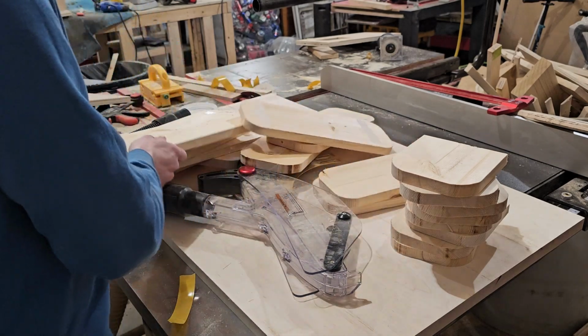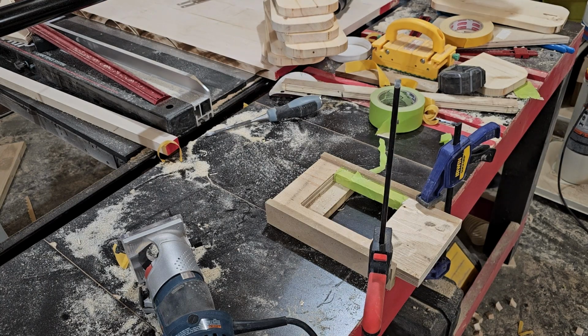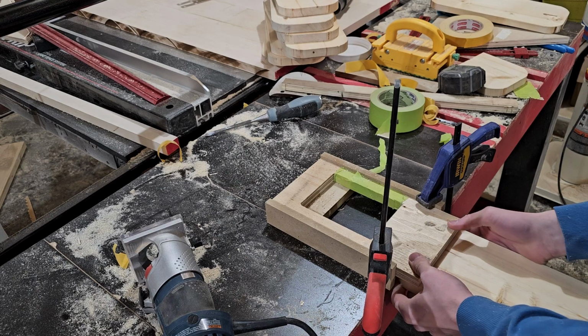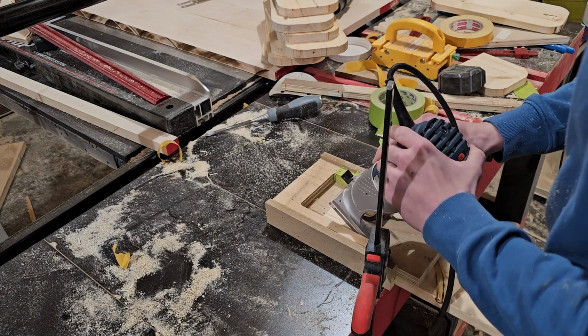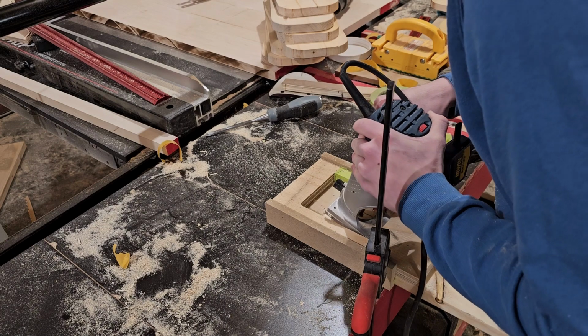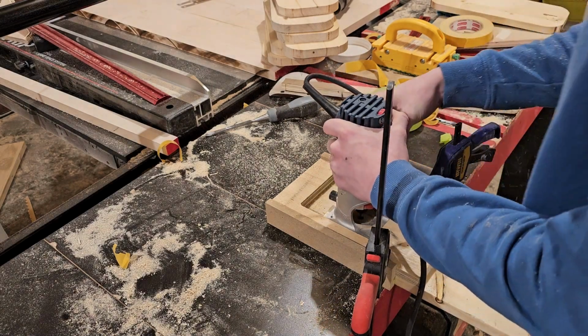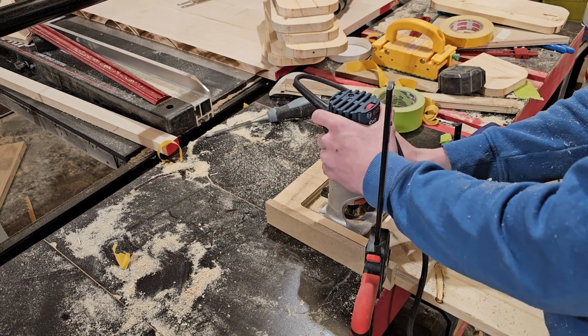Next, I did my keyholes. I found the center of my jig. I had used some tape and scraps to make it a little bit tighter. And then I used some MDF and some more plywood to give the template a frame. I could then push my 14-inch piece into the jig, slowly plunge my keyhole bit inside, move it to the top, and return to the starting position while on to clear out the debris so it doesn't get jammed.